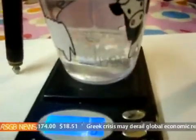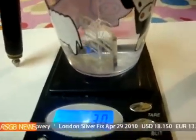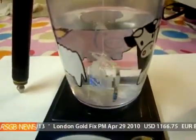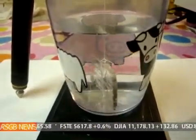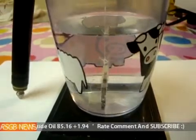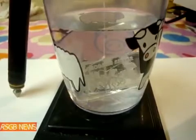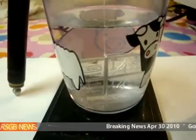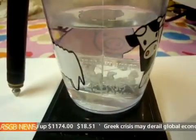Also, the reason why I'm using silver and not a gold coin is I don't have a one ounce gold coin. I have a gold sovereign, but it's a numismatic coin and I don't particularly want to mess around with it. So if you've got a gold coin and you're worried about it being fake, this is what you should have a go at. And they do say, because tungsten is very close in specific gravity to gold, it's all the tests that count. So you measure the diameter, the thickness, the weight, and then you measure the specific gravity. When you've done all those three tests, you have to then decide whether it's real or not.